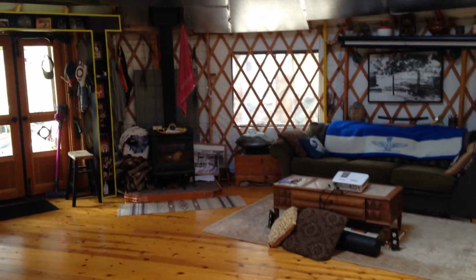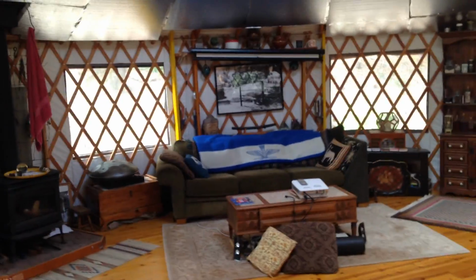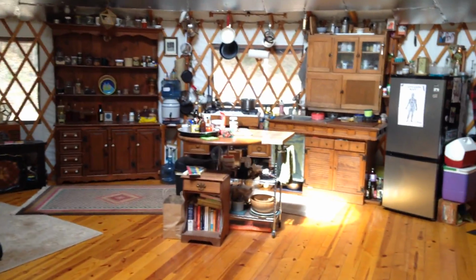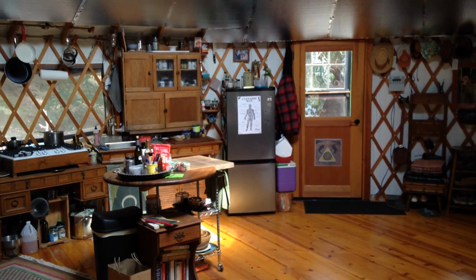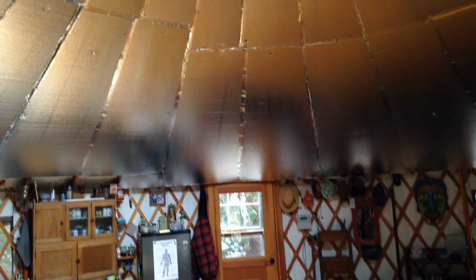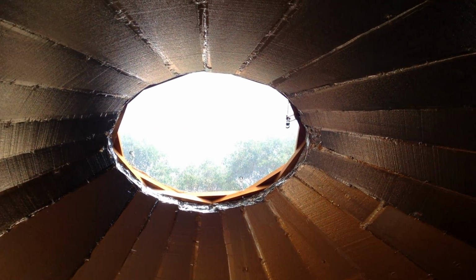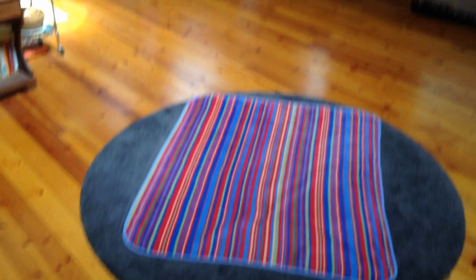This is the 30 foot. You can see online the basic package you'll buy, plus all the extra features, like insulation. It's thin insulation, so it doesn't do much. Thus, you should insulate yourself for the sake of the sound of rain and the heat of the summer days. So about 2 months ago, I added all this myself. 2-inch foam insulation, and it really helps in summer, and I expect it'll make the sound of rain less severe. It gets really loud because you're basically living in a drum when it rains.